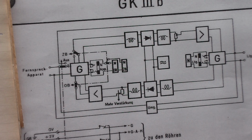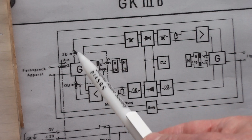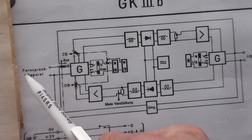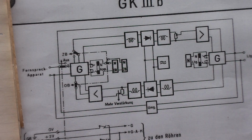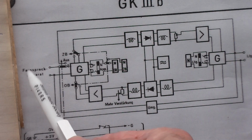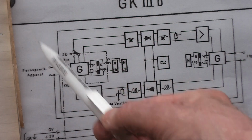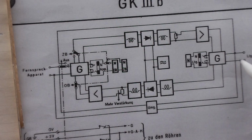do is letting both units, we have two units, you will later see it on the next film, both units are being switched in the off mode. That means the signal which is going in is coming out. In this situation we enter a tone on this point. It's being scrambled, and so the sideband is reversed, and it's going to the system from outside.